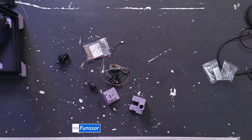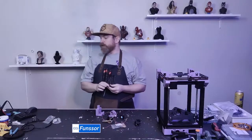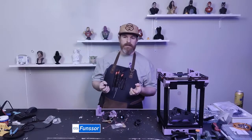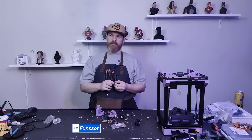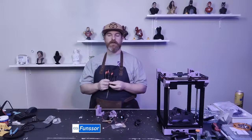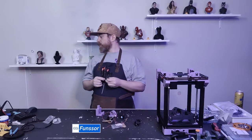If the bed is designed to be in PLA, do you need to scale it up a bit when printing ABS? That is individual. That is something that you'll have to test on your printer. Maybe print the three-piece bed and measure and see how much your parts are shrinking. But in general, when you're printing ABS, you should have calibrated your slicer to help with shrinking.